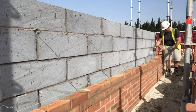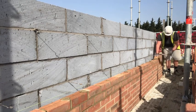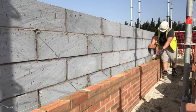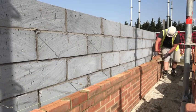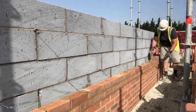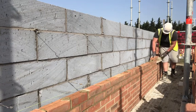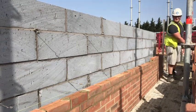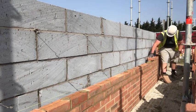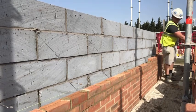This lovely weather means you've got to get the mortar a lot wetter, which isn't ideal for pick and dip. I'm too lazy for any other method now. The long spread doesn't work with these bricks — they're very very porous, they soak up the water quickly — especially with the mortar we're using, the Tarmac old batch. It's a khaki green, very sticky, a bit shitty to work with, but not the worst.